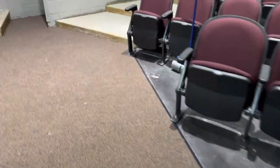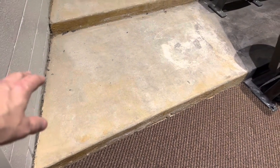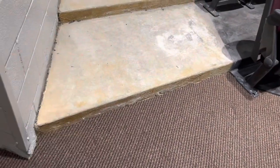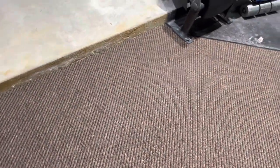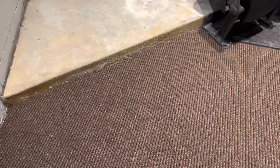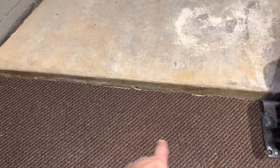And over here, these are five foot apiece. And these over here were going to take about six and a half foot of carpet - six foot wide, six foot depth. It would have taken six foot of carpet to do each one of these steps. Now they're taking three foot nine inches. So what we're going to do, we're going to have them run where the pile comes over the step straight like that.